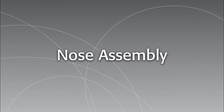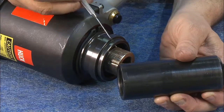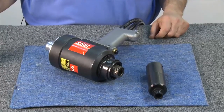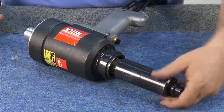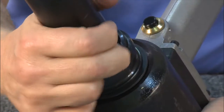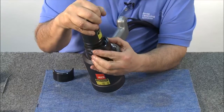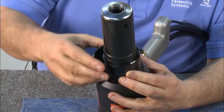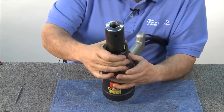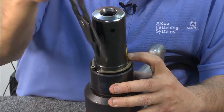Now, we'll add the nose assembly. Note: on the collet there is a machined flat. Thread the collet on until this machined flat is flush with the face of the adapter. Before attaching the collet, cycle the tool once more to make sure it's in the full forward position. Thread on the collet, taking note of where the flat is lining up. When the flat starts to disappear, hold in the ball lock on the collet and rotate until it starts to disappear in one of the grooves on the piston. Push down the anvil and install the first section of the half ring between the adapter and anvil. Install the other section of the clip ring. Slide the sleeve over the half rings. Slide on the TruArc ring. Using pliers, spread the ring and slide it down into the groove.